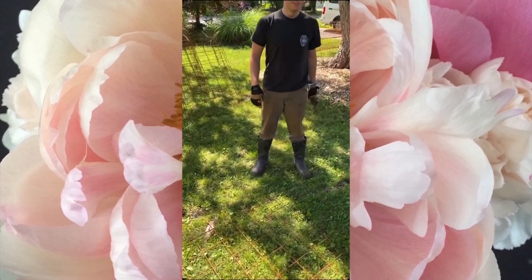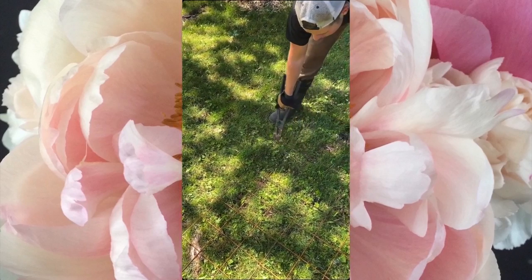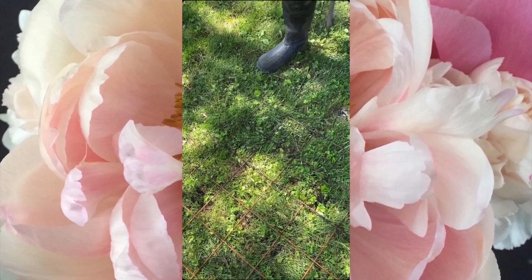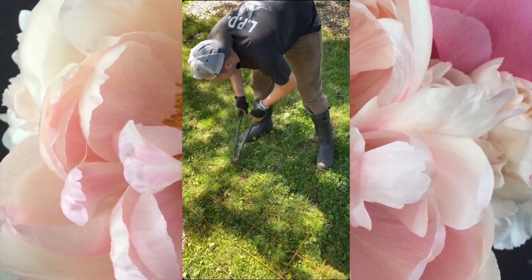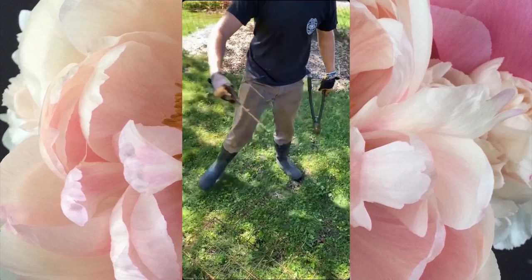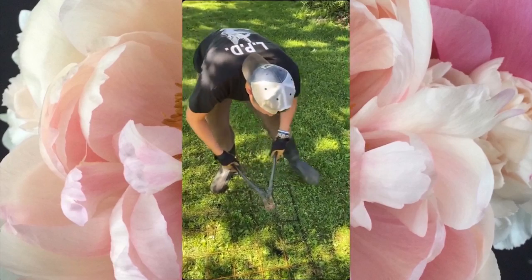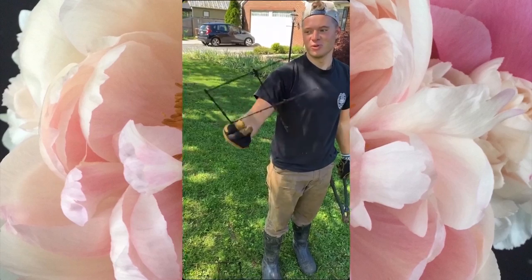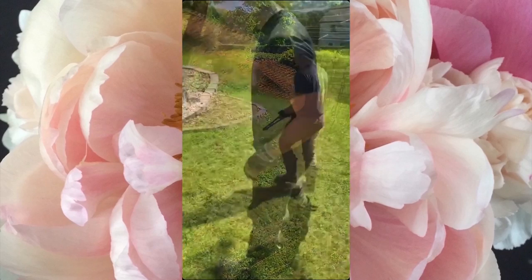Now, in order to make your rectangular prism shape, you're going to cut out a two-by-two section of the cage at each corner to make a little flap, so that when you fold them up it makes a nice three-dimensional rectangle. Bryce shows the cut shape — we call it the 'angelfish.' Cutting the corners out allows us to bend up the sides the way we need to.